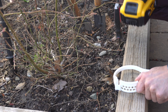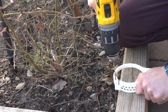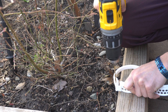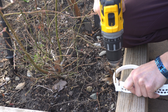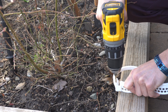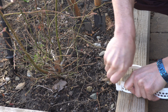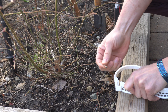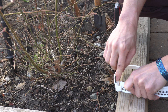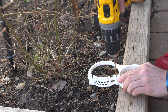All right, so welcome to my high-tech outdoor work area — the garden. Remember, I'm running this in reverse nice and slow. I'm going to try and eyeball it and go straight down, but hopefully the hole itself will guide the drill bit too. So one — done. And then you can take this little bit just to make sure it fits in there. We're going to look at tapping it in shortly, and it's actually still snug — it's not just going to drop right in. If you tried to tap this in without reaming out the hole a little bit, you would definitely crack it. This one in the middle is scary because there's not a whole lot of sidewall, so you got to proceed with caution.